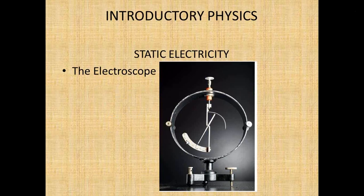You have to know what an electroscope is. This is the needle electroscope. When you see a device like this and the needle deviates, that means it's charged. The charge on the needle and this vertical conducting bar is the same. Like charges repel — that is why the needle deviates.